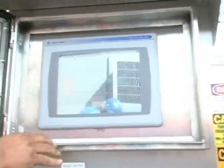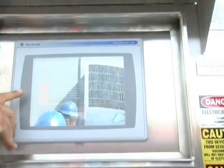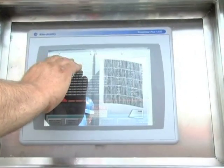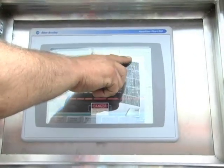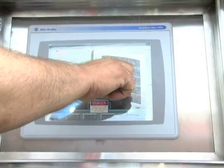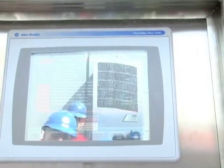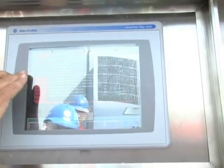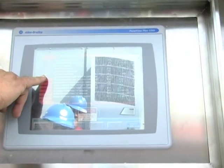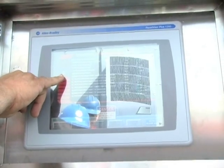Transmitter monitor page — this lists all the transmitter monitors: vibrations, temperatures. Here you've got your IGV position, your guide vane position, your diffuser vane position, inlet air temperature. This is the differential pressure we were talking about — the difference between input and output. Your reservoir temp, main motor amperage, your slow speed inner and outer bearing temperatures on the blower.